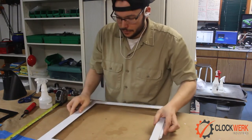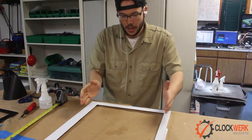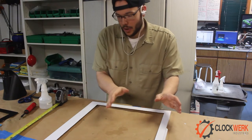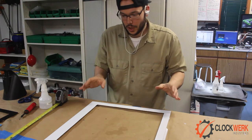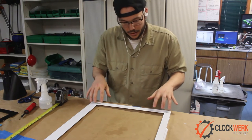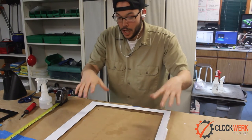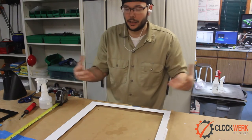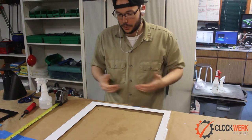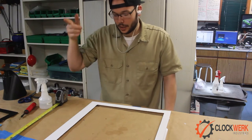And then on this side, the way the lip, the hanger, is inside, the latch onto the door, I'm gonna make 1-inch trim, and I'm gonna offset the trim when I glue it on. So the trim will be centered on the outside of the door panel, but it'll actually be shifted on the window. But you won't see that because the trim will make everything look centered and even out the whole window install. So right now I'm gonna head over to Fusion, get this whole thing modeled up, and then head over to CNC.